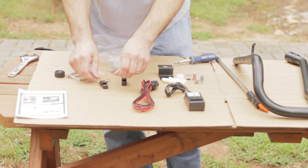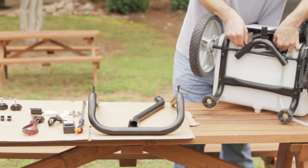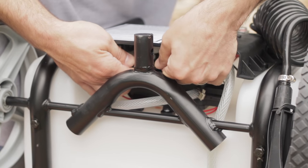The very first thing you need to do is tip the cart over on its side and connect the power plugs together. The cables with the black ends go together. It's very important that you do not plug either of the black cables into the one with the red connector — you will blow the fuse link.